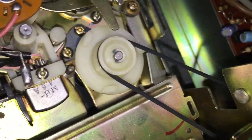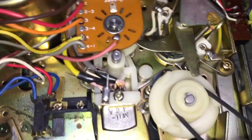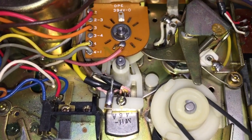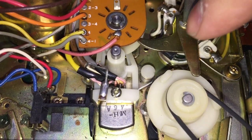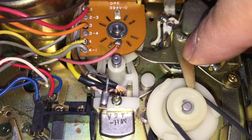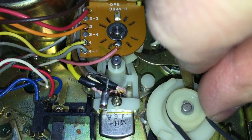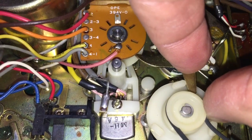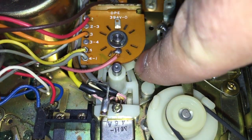As far as the way this thing is set up, there is the belt that runs the tape counter there, the real-time tape counter. And then the way it selects or changes tracks is really unusual. In fact, if you've ever taken a 2XL 8-track robot apart, and I have a demonstration of one of those on my channel, the mechanism is very similar to this. In fact, it's identical. What it does is, this is a solenoid here. So when you press the program change button, it activates an electromagnet, which then comes down, and then as this little piece here turns, it causes this to push on that piece there, which then flips a little table underneath here and then changes the position of the head.